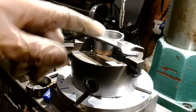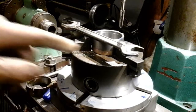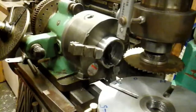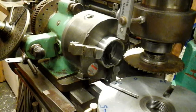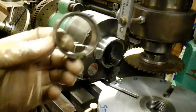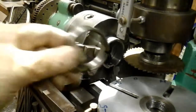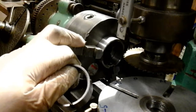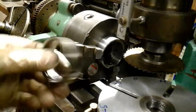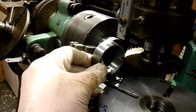What I'm going to do now is take this chuck off because it's all finished with those operations, and put my chuck onto the dividing head. Then I can set my slot 90 degrees to my groove and cut my groove for the advance and retard mechanism. Sorry about that — it's been a while setting the machine up because I had to move everything, drop the head and everything to get down low enough to machine this slot. Looking at my original cam ring here, I've just milled that one in my rotary table and now I'm going to cut this slot at 90 degrees. I've put it in my dividing head. You don't have to use a dividing head — it's just that mine was already on the machine, so it'll be easier to move it around 90 degrees. You can use many methods to get this 90 degree slot.